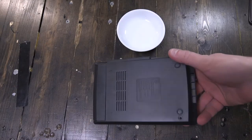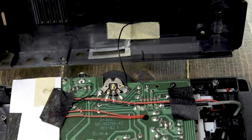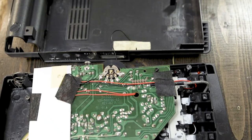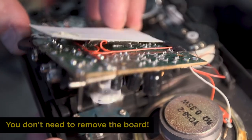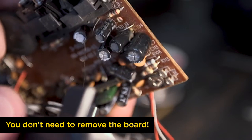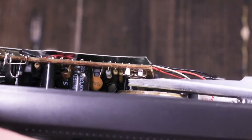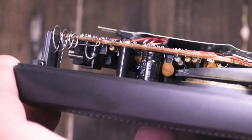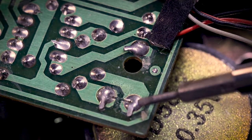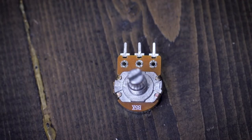Next, we'll get the unit open and take a peek inside. The first thing I do is remove the ground wire so I can separate the cover from the back. You'll also want to move the shielding paper out of the way while you work. As most cassette players do, these guys have an easily accessible trim pot that's used to fine-tune the playback speed. I actually clip these off pin by pin. I found that trying to desolder and unbend these pins can really mess up the board. We're going to replace this with a potentiometer that has less resistance.